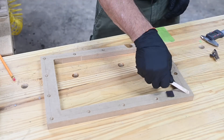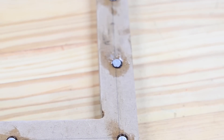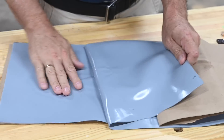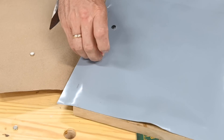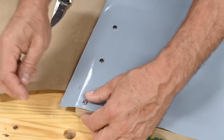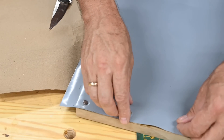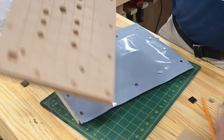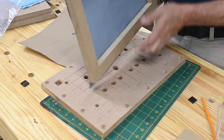The magnets are all epoxied into the top using good old 5-minute epoxy from Home Depot. Here's the silicone membrane material — this cost me about 50 bucks and there's plenty to spare for when the membrane wears out, which they do eventually. I'll lay it out and then pop a second set of magnets on to hold it in place. Most guys who make vacuum tables use tops that clamp the membrane in place with screws and a double-layer frame, but I saw somebody do this magnet trick and it was obvious it would make changing membranes way easier as well as making the frame smaller and simpler. I was concerned it might not hold very well but that turned out not to be a problem.